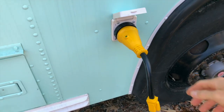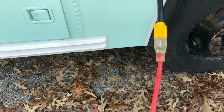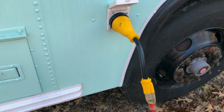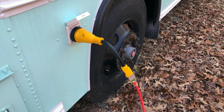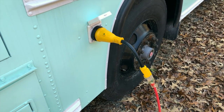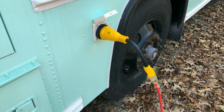On the outside of our bus we have what's called a dog bone — a 50 amp to 20 amp hookup — and a 12 gauge electrical line running back to a GFCI on the outside. This allows us to plug into any regular 110 connection, or into a 50 amp service when we go to a campsite. We're not running a microwave, AC, or a massive heater, so we really don't need that much of a connection — but because our inverter charger has that capability, I wanted to make sure we would as well.